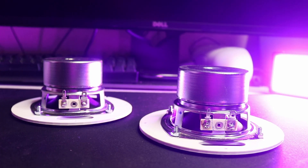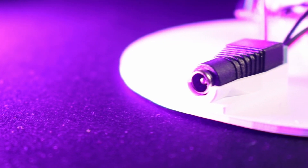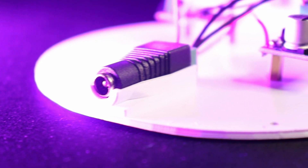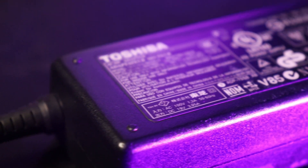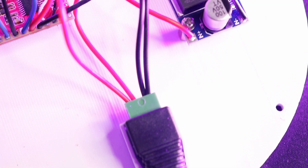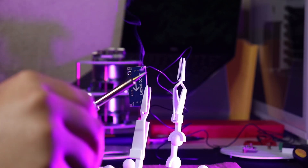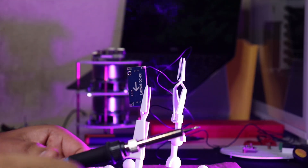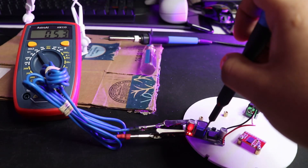Following the first base are two bases for the speakers, which hold two 79mm diameter speakers. And the final layer is built for the electric components of the build. First, we have a 5.5mm DC female adapter — this is how we power the entire system using an old 20V laptop charger. Following the DC adapter, the wiring breaks into two parts. The first is a buck converter. Because the Raspberry Pi is limited to a 5.1V power supply, we need a way to step down the 20V from the laptop charger, and this component allows us to do just that.